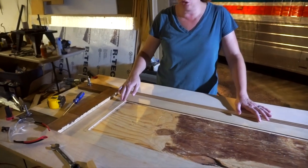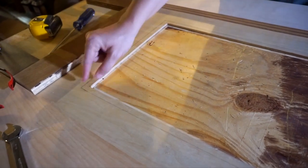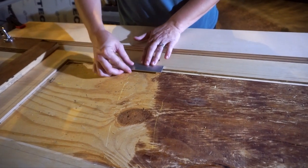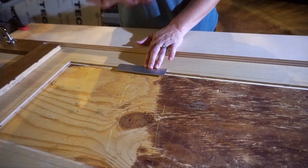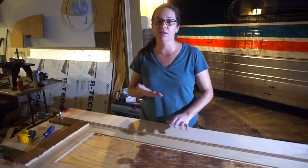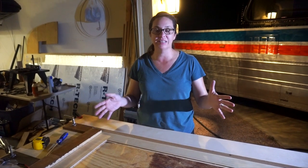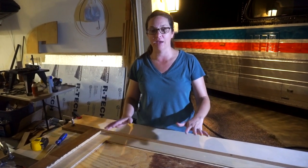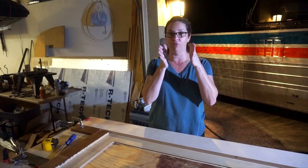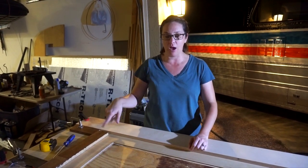So what we're going to do is route out a half-inch wide, eighth-of-an-inch deep channel all the way around so that we can inset a one-inch frame of eighth-inch aluminum that will secure our mirror and act as a frame, keeping it in place. That way, if the mirror ever breaks or needs to be changed, we can just detach the aluminum framework, swap out the mirror — it's a standard size — put a new one in, put the aluminum framework back, and it's all good. It should all be perfectly flush, which we need given the limited width in our pocket.